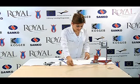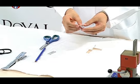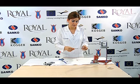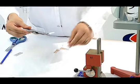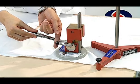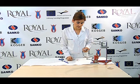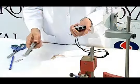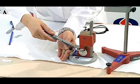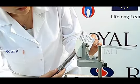From the weft and warp samples, the warp specimen is folded in a way that two halves of its front side become face to face. Without touching the folding place, the sample is held with the tongs at 5 mm from the edge and is placed in the load cell. The chronometer is started at the same time. We wait for 5 minutes. At the end of the 5-minute duration, it is held at 5 mm on one edge and placed between the clamps, whereby we measure the folding angle.